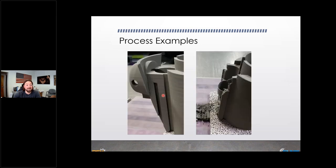Another gravity failure example: a well-printed piece with weight hanging off the outside of the wall. The wall itself mostly stayed intact, but the unsupported overhanging part fell off during the first stage of debinding. If there had been a support structure underneath or some gusseting, the part would have had a chance. We did help this customer redesign the part and were able to successfully process it — sadly we didn't get the final picture.